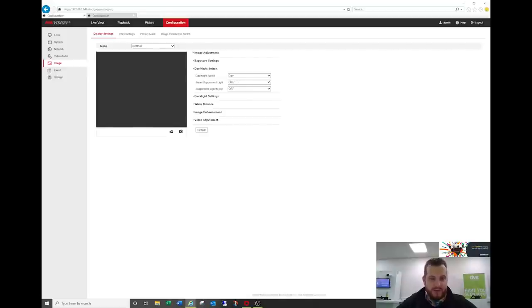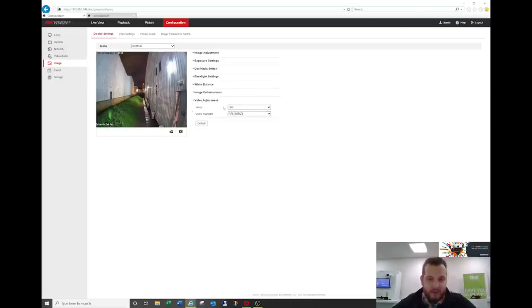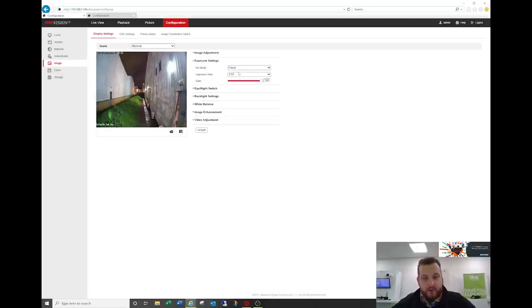Already you're going to see a fantastic image and it is around 7:20pm so it's as dark as it's going to get. You can see the outside of our building with the white lights on, which I'll turn off shortly. Under image settings, we've forced it into day mode first to show what it looks like with the supplementary lights on, then with lights off you can see the performance with no white light versus the DarkFighter. Smart supplement light is off, forced into day mode, no backlight settings. Exposure is set to 1/12 by default — you can't adjust it — and gain is full up.